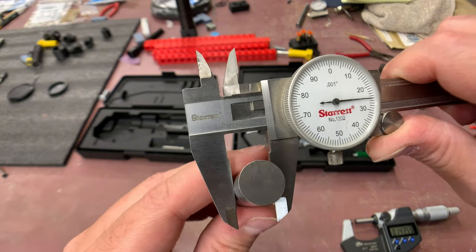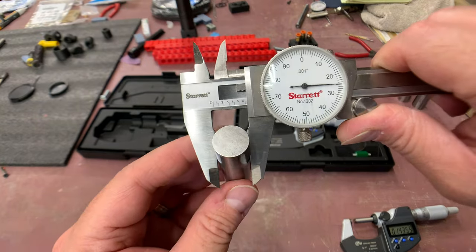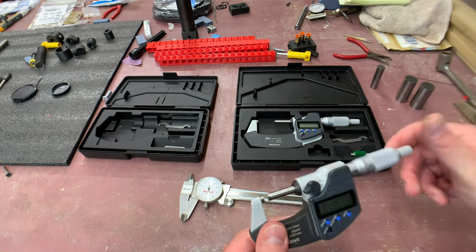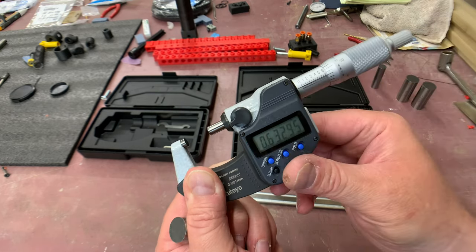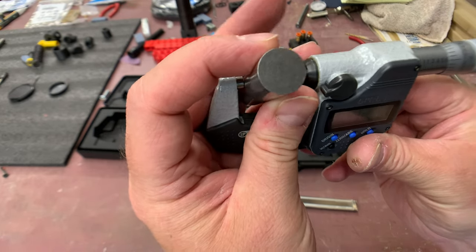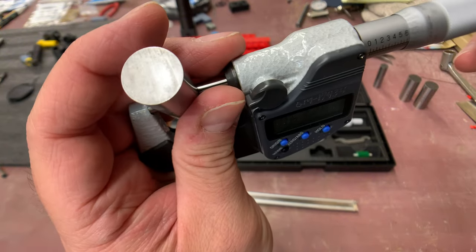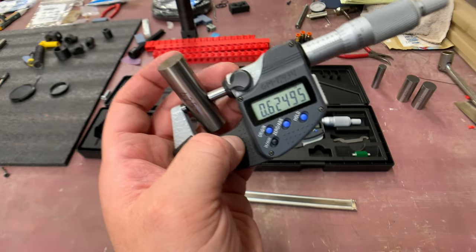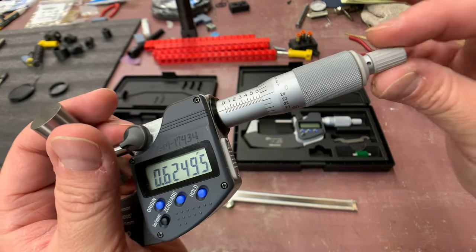You've got to really work on your pressure - feel it with your thumb, work it back and forth, spin it even, and get an equilibrium so you know your measurement. You can get very accurate measurements with calipers but you have to be careful; it's all about feel and repetition. With the micrometer, give yourself some clearance oversize. You have to get the pin between the anvils to get the tangent on the anvil - these hardened carbide tips are the anvils and they provide an accurate measurement.